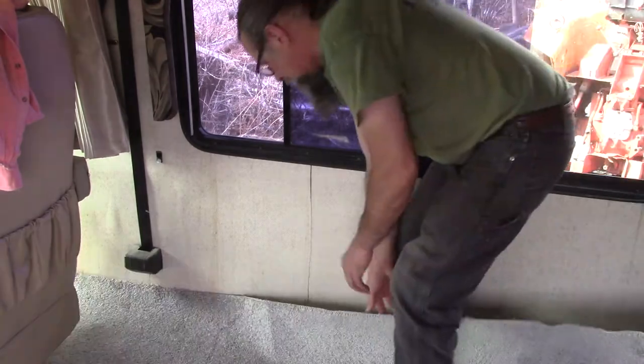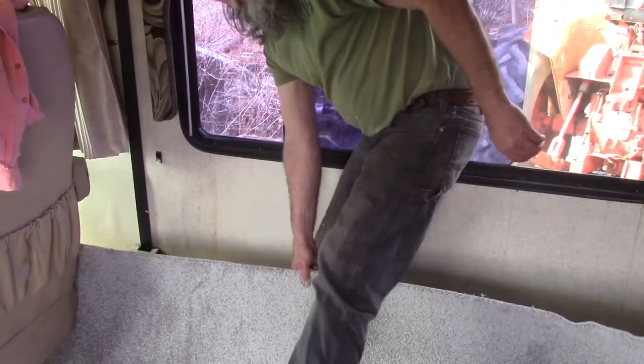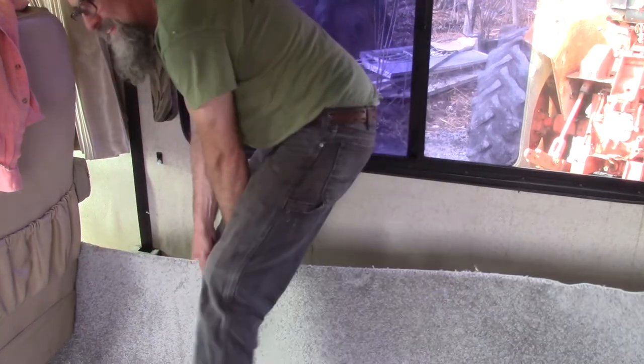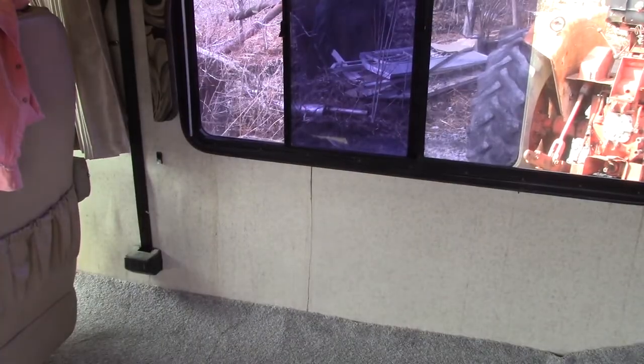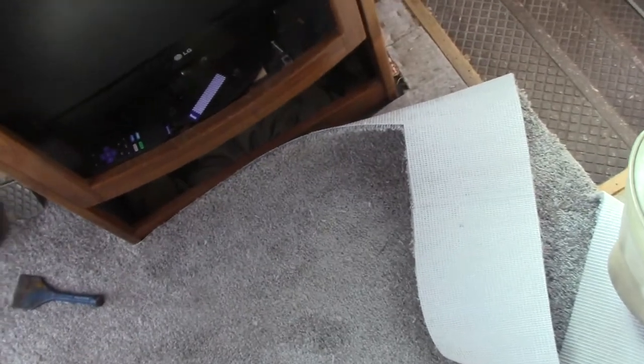With any luck, I got this wall hooked into that tackless strip. Then I'm going to set up over here, pull away from the wall and try to kick it over. I'm just going to roll this carpet up away from the wall, get a foot in here, another foot here, and just try to kick it over. I'm probably shaking the camera — but it is kicking it over. That seems to be hooking. Try to get it a little tighter. I think that's pretty good, though it's not all hooked everywhere. Carpet guys earn their money. Even though I'm not a carpet pro, it's starting to look pretty good. I've got it worked around there — still have some work to do around the pedals and around the television set.